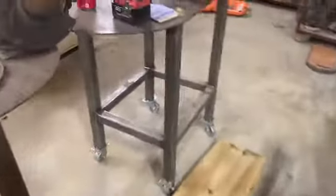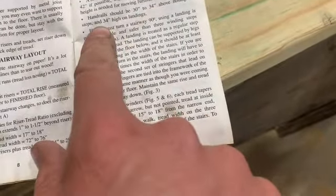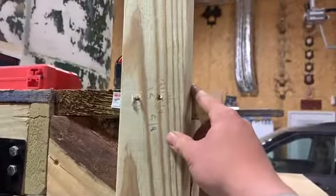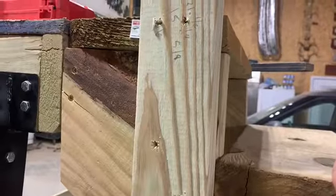These are the stair treads. Now I'll move on to the handrail. The little book says handrails should be 30 to 34 inches above the nosing of the steps, and 34 inches high on the landing. The nosing of the step is that part right there. That one was around the 34-inch mark - a little tall - so I'm going to bump that down. My measurement from bottom of the stringer to top of the nosing is 15 inches, so I'm going to add that to 30.